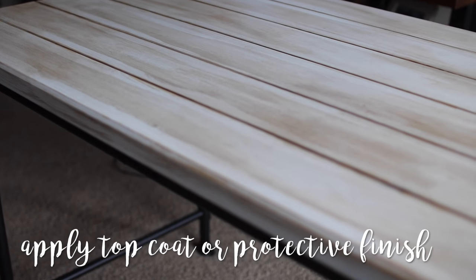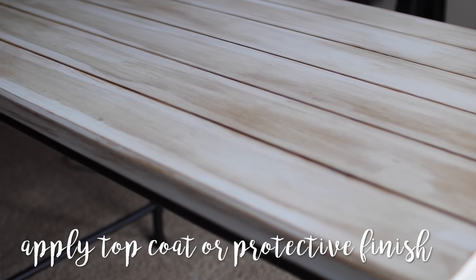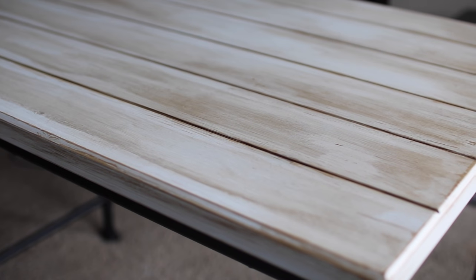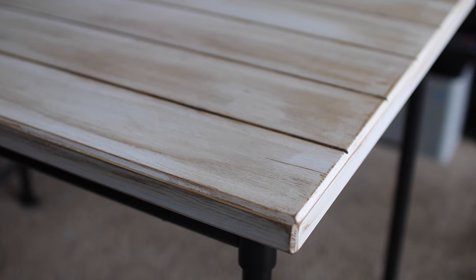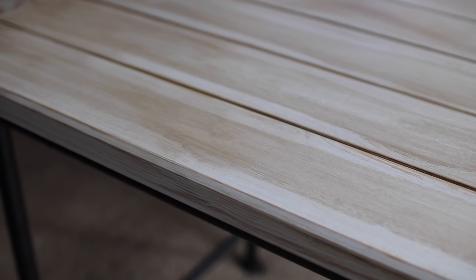After everything's had time to dry, you can seal the finish with a protective top coat or leave as is. Keep in mind what this piece of furniture will be used for. A lot of people stated that they didn't think wax was a great idea for things that were going to get used a lot, like dining tables or desks, and it's mostly just for items that are for decoration. So keep that in mind when finishing or sealing it, especially if you're not going to be using a glass table top. For my desk, I left it out overnight to give everything time to dry, and the next morning we added the glass table top.